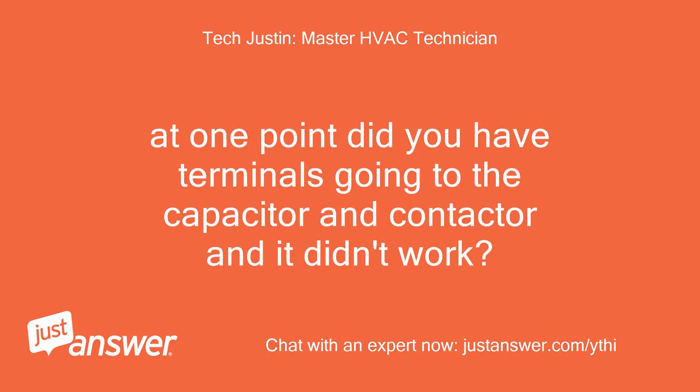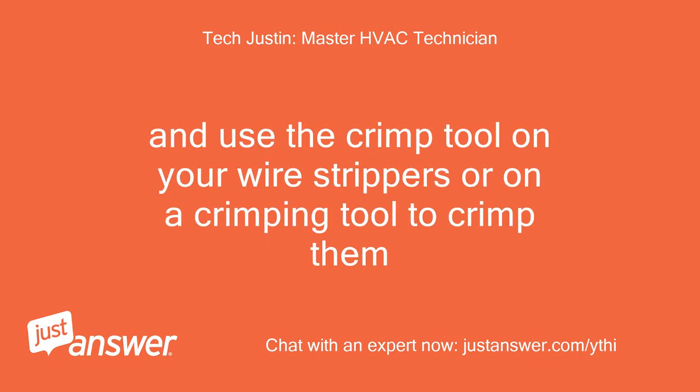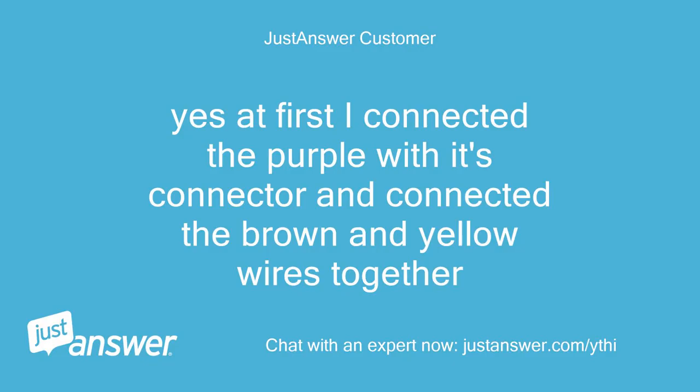At one point did you have terminals going to the capacitor and contactor and it didn't work? You can get those at a hardware store for a few dollars at most, and use the crimp tool on your wire strippers or on a crimping tool to crimp them. Yes, at first I connected the purple with its connector and connected the brown and yellow wires together.